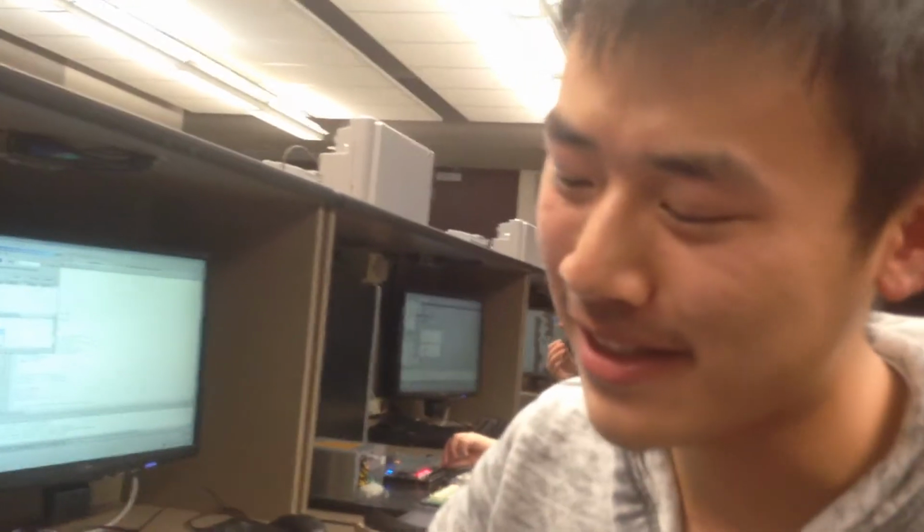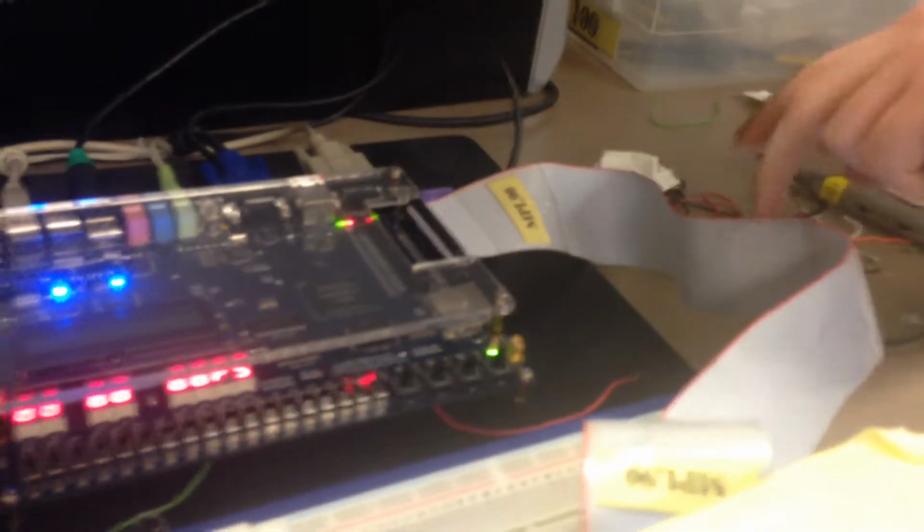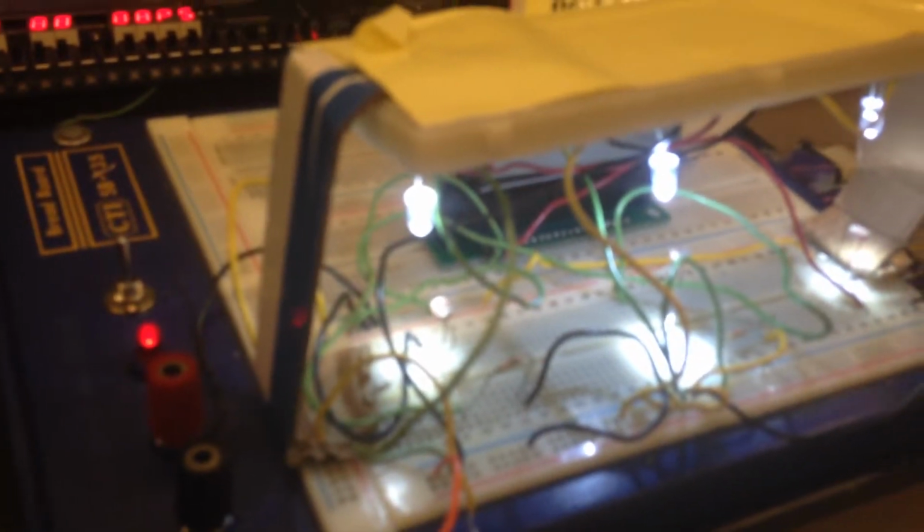And then what I think is a little challenging about this project is that we've never used GPIO before. So we have to figure out what the initial value of GPIO is, which is actually 1. We didn't think it was going to be 1. So we tested it, and we saw it was 1, and then we used the circuit to change it to the initial value we want. And then the GPIO, we have to connect it to the JP2, which we've never used as well, which is very interesting to learn about. That way we can access the output of the resistors in our code.